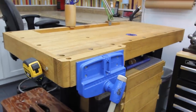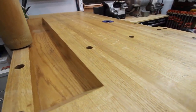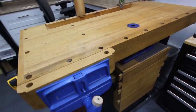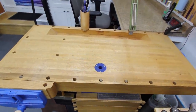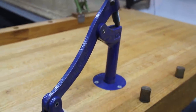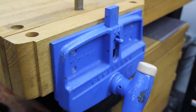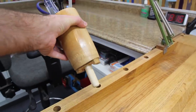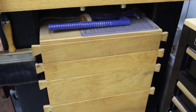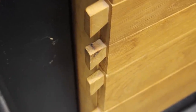Workbench. This is a simple little workbench I built for myself several years ago out of recycled ash wood. There's a built-in tool tray and two vintage Craftsman vices. There are various ways of anchoring down your project including this old hold-down clamp and some brass Veritas bench dogs. I made this little removable pencil holder that won't tip over. I also made this set of drawers which are great for storage but also add weight to the bench. The drawer fronts are flush with the front of the bench, and since I couldn't have drawer pulls that stuck out when holding stock vertically in the vise, I carved these little dovetail handles into the side of each drawer front.